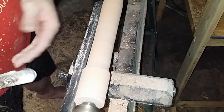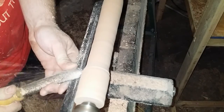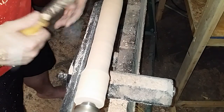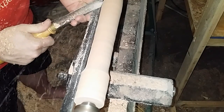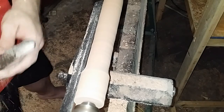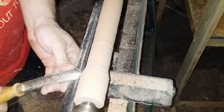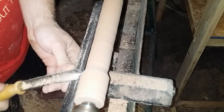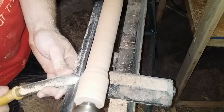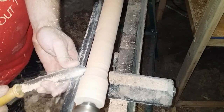The farther out you get, the less it'll be shake-wise, vibration. Center, get it as best you can with the tool as slow as you can, and have a sharp tool. Takes longer, but it's less sandpapering in the end. Sandpaper's the only thing that's gonna get that smooth. Remember, this is red oak, so it'll splinter really bad. A lot of tear out. Your sharp tool is important.